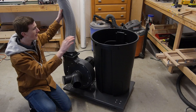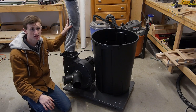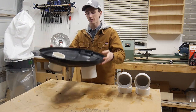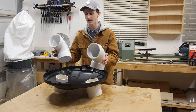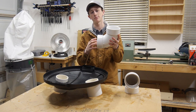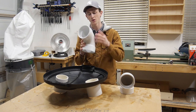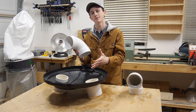Other than that I'm going to go ahead and finish up the top part of the silicone, then we should be able to start attaching the hoses and all that good stuff. Now that my silicone is fully cured on both coupler pieces I can go ahead and flip over my trash can lid. On the inside I'm going to be adding my 90 degree elbows, but before I do this I'm going to be cutting off only one of the 4 inch ends that accepts the pipe. This is hopefully going to decrease the weight as well as increase the airflow, so this is something I want to do to try to maximize the airflow the best I can.